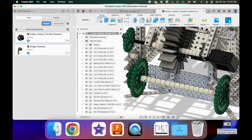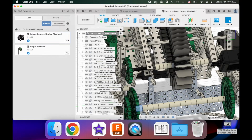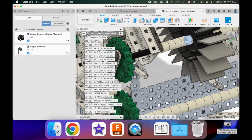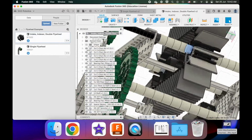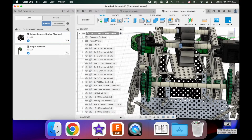But I've found in my experience that if you just got rid of all these spacers and just put 2 shaft collars, we have one in this file, pieces like this, right, with the set screw that digs into the axle. If you have 2 shaft collars on either side, the sprockets will not come together, okay?